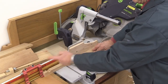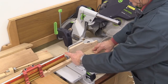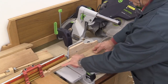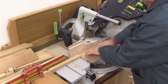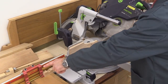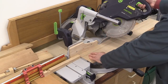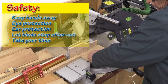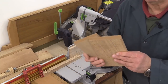Because my repeat stop only starts at 300, to do something which is less than 300 long I have a piece here which has been measured to the exact length so that I can do cuts which are 300 minus whatever it says on the gauge. So I've set this at 500 and I now know I'm going to do cuts which are 200. So that's my two sides, top and bottom, done.